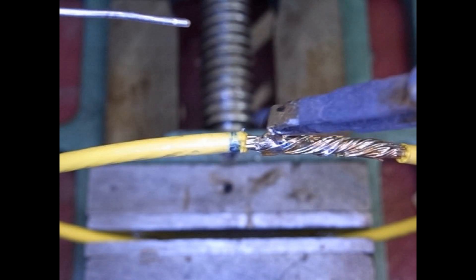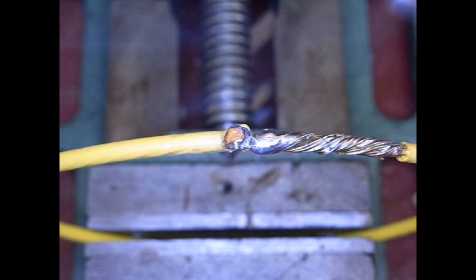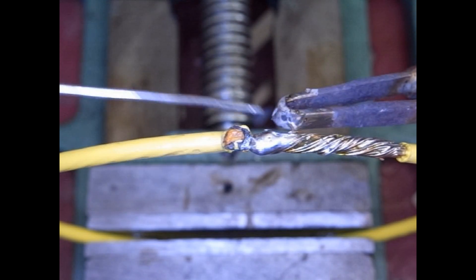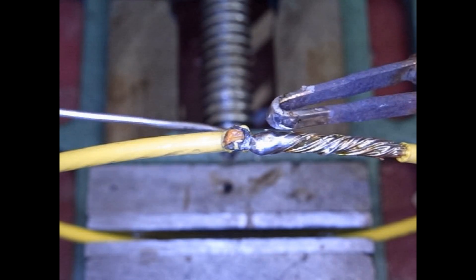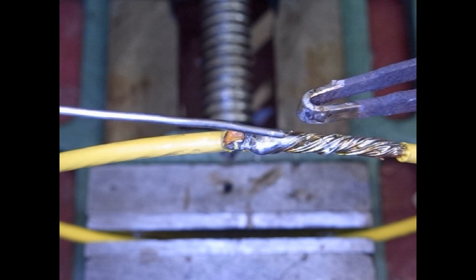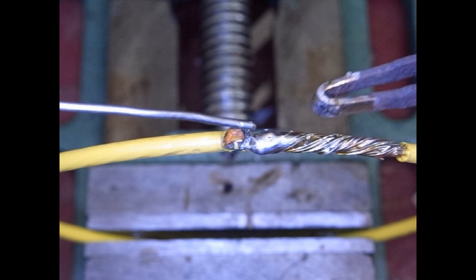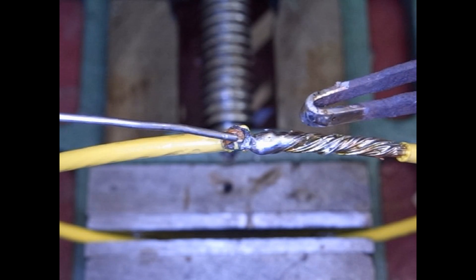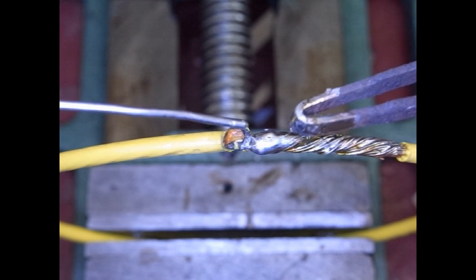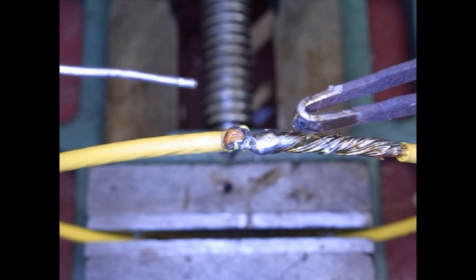You can mess up a good soldering joint by getting into the plastic over here. You can see the smoke pouring off of it, and now see how ugly my tip looks — see the nice carbon on there? That spot will not hold solder, and if I drag it back through the joint it will contaminate the rest of my joint, making it an ugly joint too. So if you get into the plastic, into the insulation, or touch something you're not supposed to with the soldering iron, clean the tip off before you continue. Just immediately — don't drag it back into your work. Stop. Go clean it.